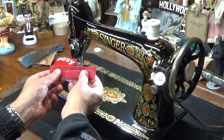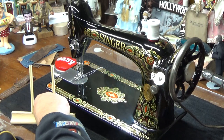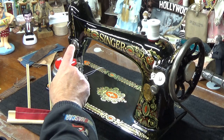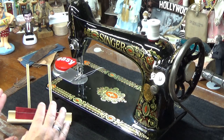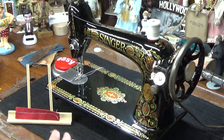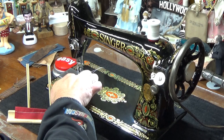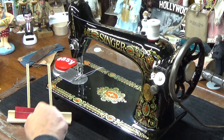Remember the upper tension. I'll actually zoom in on this and put it in a position where Barb can see it as well. The upper tension unit, this unit right here, is going to be pulling up to define the lock stitch, which when we look at it, you're going to see a lock stitch that is just, wow, fantastic. But when the upper tension is turned up too high, it overpowers the bobbin case down here from being able to pull down to define the top stitch.